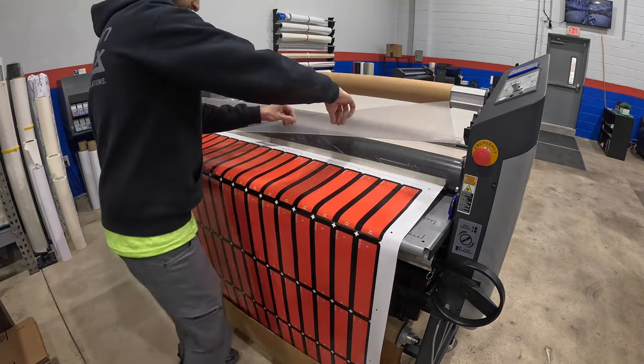And then there's this little notch or peg, and that goes into a notch on this side. So I'm gonna drop that in, press the button on the front again. Tighten it down. Nice and tight. And now that tool should be ready to go. So we're gonna press online. And the machine is going to read the barcode that's printed on the tool. And then it's also going to check the depth of the blade in the automatic depth control, the ADC right there with the red light. So it's actually shooting that beam across, and it's measuring how far down that blade is.